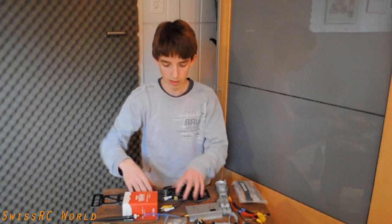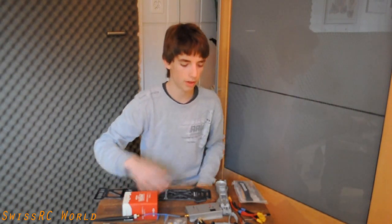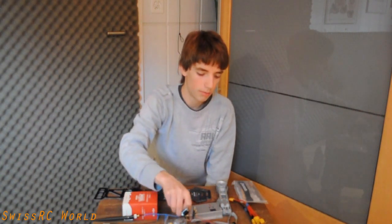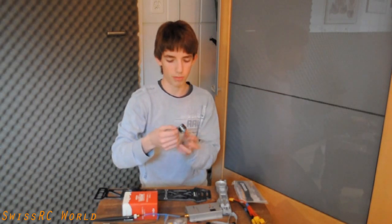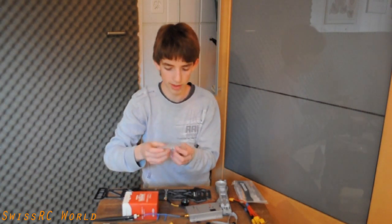4 of these for the quad, and just an AV cable for the video. Then I got the 2 dirty plates and the 2 clean plates for my QAV400. My ESCs are going to be the HobbyKing 20 Amp Blue Series, just because they are very lightweight and they are also made — not specifically, but also — for multi-rotors. The motors I'm going to be using are some Turnigy NTM, I think 28-26, 1200kV motors.